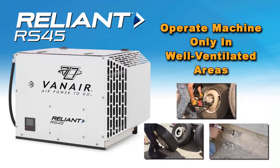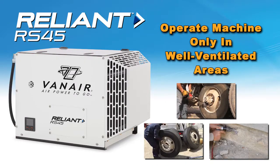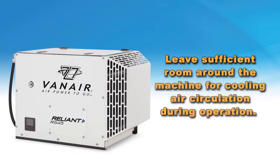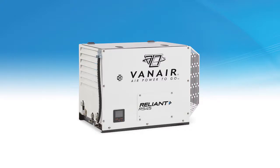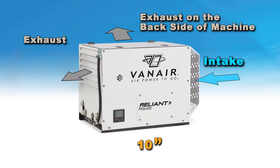When using the Reliant RS45, operate the machine only in well-ventilated areas. Be sure to leave sufficient room around the machine for cooling air circulation during operation. There must be a minimum of 10 inches for the cooler intake and 10 inches for the sides and rear of the machine. Heated air must be able to vent away from the intake.